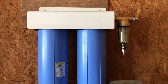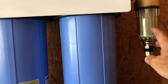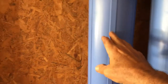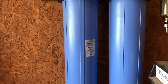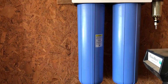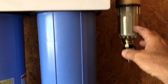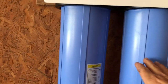There's the filter system. The spin-down filter is 200 microns. To start with I'm going to put a 50-micron filter in the first housing and maybe a 10 in the second. I'll experiment over the first year to figure out what the best micron ratings should be for my well water. Starting with a 200-micron spin-down, there's so much junk in the water that's probably going to work, and we'll see how it goes with a 50 and maybe a 10.